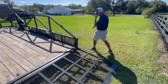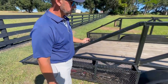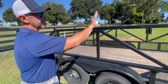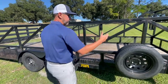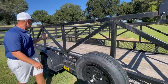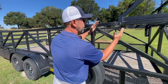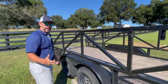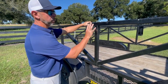We added two-inch tubing as a top shelf rack here, and I also put tie-downs throughout. So if you had to tie anything down, you can. The reason we stand our units up is that laying them down and re-picking them back up is tough and you're not utilizing your room that way. If I take a six-foot unit and lay it here, and another six-footer there — you're already running out of room with four units on an 18-foot trailer, which is crazy. So if I can stand them up with a small lean, I can triple the amount compared to the guy that's laying them down. The easiest way to do it is add extensions so it holds in properly.